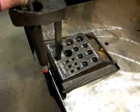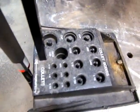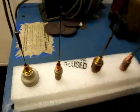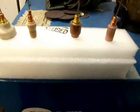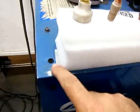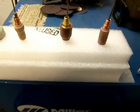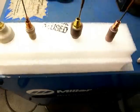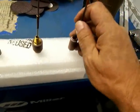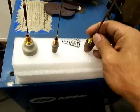So I found a little trick that's worked pretty well for me. What that is, is using a piece of high density foam to hold the electrodes and stack all the TIG parts on them like a shish kebab. So all your commonly used setups — a number seven gas lens, maybe a number five standard collet body, a lava nozzle with a different size electrode, and a big oversized electrode. Different people do different types of work, so they're going to need different sizes of cups, and some are going to need a gas lens and some aren't. You can put your most commonly used setups in the foam — sharpen the electrodes first, stab them down into the foam, then line everything up.